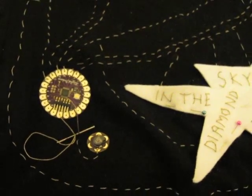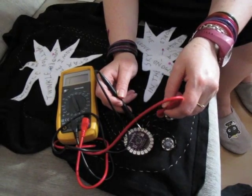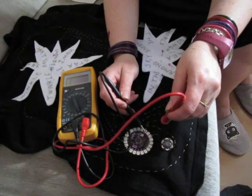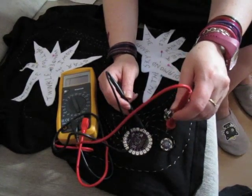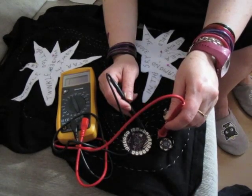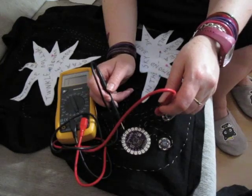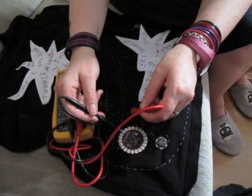Annoyingly, there was a problem. The buzzer was not playing the notes correctly, and after some thinking and testing with a multimeter, crocodile clips and a single resistor, a solution was concluded — I'd need to add some resistors. Unconnected, the circuit is connected to high, but when the stylus touches a word, it creates a simple circuit through the resistor and pulls it down to low.